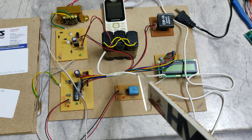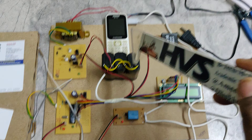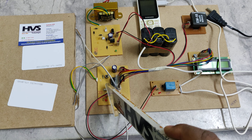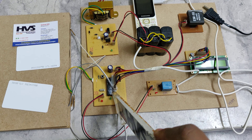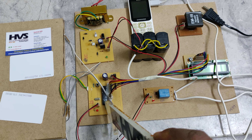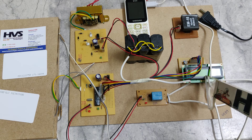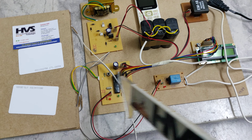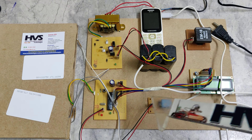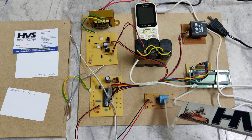The power port is connected from this white wire through this relay to our phone. The main input modules are: piezoelectric plates connected to the A0 pin of the ATmega328P microcontroller, RFID reader connected at the receiver pin, Port B connected to a 16 by 2 LCD screen, and relay connected to the C3 pin. Whenever we show the RFID tag, it checks the identification number.